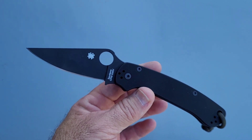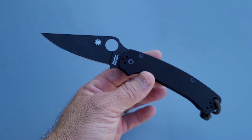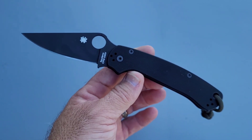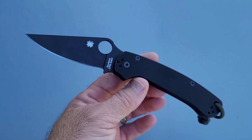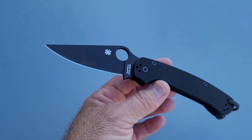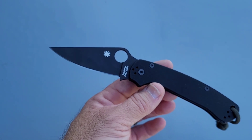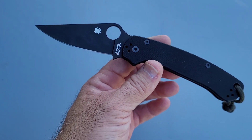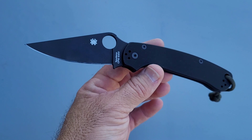So I ran that test, got busy, and it sat for a while. Went ahead and got it finished up. Put the second edge on it, cut it off, put the third edge on it, and ran the test again. On the third edge: 127 feet fine edge, 93 feet working edge, for a total of 220 feet. Sharpened it again the same way as always — for those new viewers, up to 1500 grit on the KME, stropped 5 passes per side on 6, 3, and 1 micron, then cut in a one inch section. On the fourth edge: 130 feet fine edge, 95 feet working edge, for a total of 225 feet.